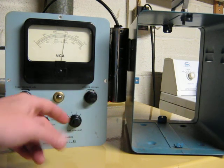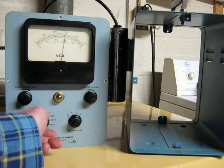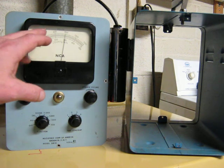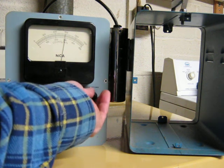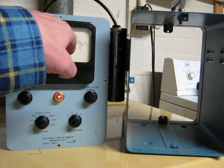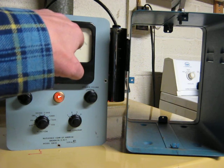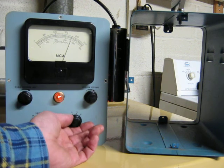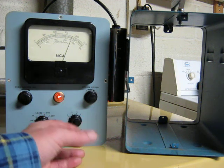In the cal mode, for each range, it has adjustments. In the cal mode you would expect to see 3,600 counts. It's a little noisy — but there's 3,000, and it's pretty doggone close, about 3,600. So it looks like the meter circuitry is pretty close. I have never calibrated this — I've replaced components, but I've never calibrated it. There are a bunch of pots in this thing.